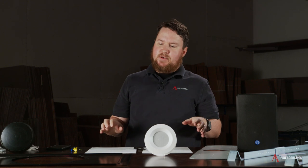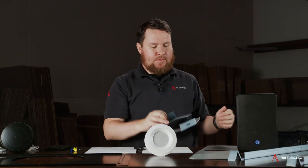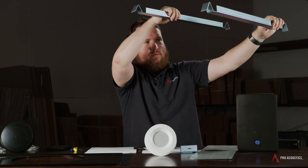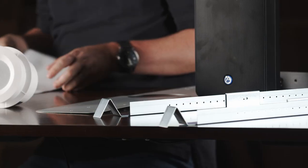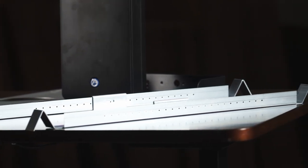Sometimes, rather than doing a tile bridge, other speakers may use what's called tile rails and a C-ring. Basically, these tile rails lay across your T-bar ceiling, and then the C-ring lays across the rails and mounts your speaker into that. So that's another option you have as far as drop tile mounts go.